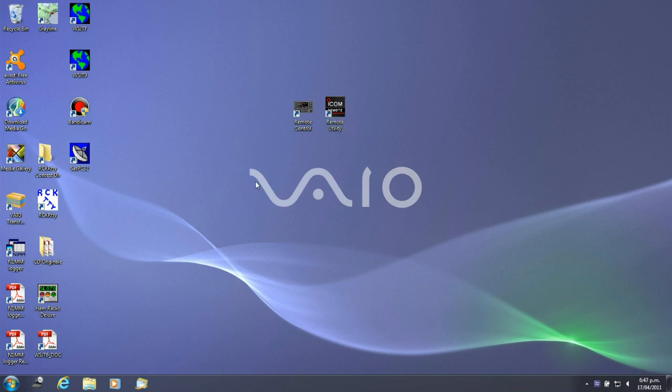Just a reminder, to install the software, just run the executable in this package. Do not have the radio connected via the cable, don't have anything connected to the CIV port, just have the PC install the software, install the drivers, and then once all that's done, plug in the USB port, and the PC will initialize all the drivers and the COM port numbers. The thing to remember about that is also just let it take its time. It might take a few minutes on the first time. So run up the control panel.